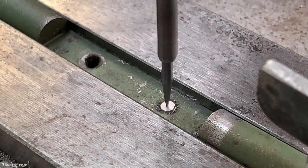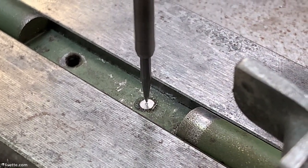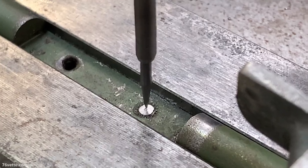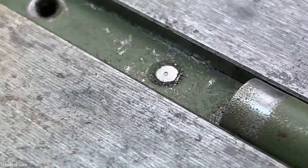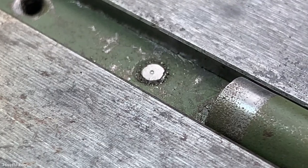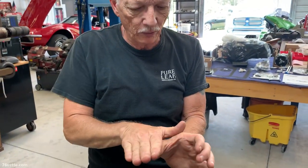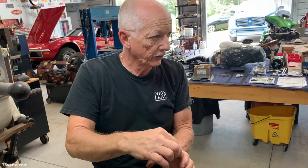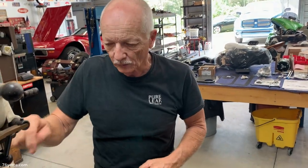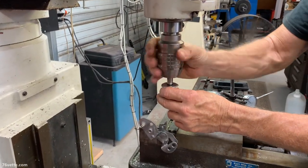Even once I get it set here, I still might have to adjust a bit once I come in and touch with the center drill and see how it looks, because sometimes on a threaded hole — if you file it down smooth — it can look like you're centered with the screw, but technically it's hard to explain. Because of the thread going down on one side, you won't see that thread on the other side. So it looks like you should come this way more because the hole looks further that way even though it's not. Once you start drilling you can kind of adjust a little bit for that.